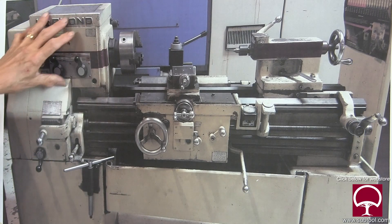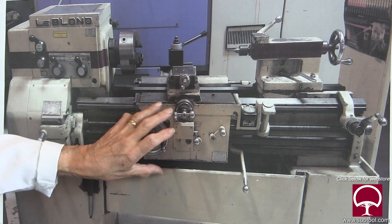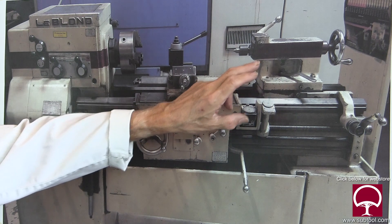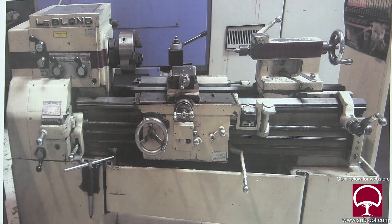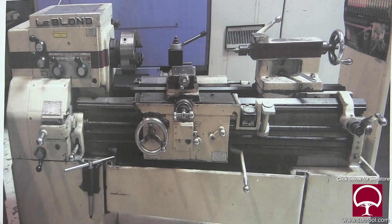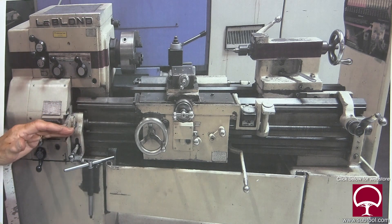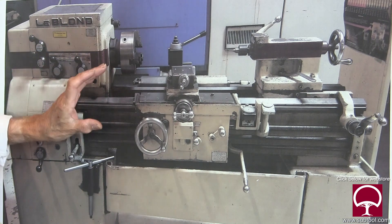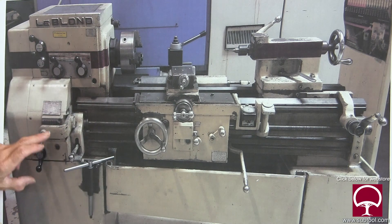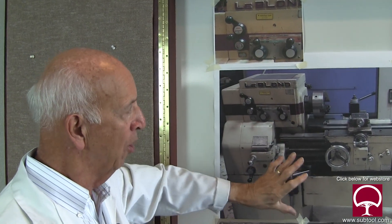This is, of course, the main gearbox. This is the chuck, which you clamp your part in. The carriage goes right and left, one goes in and out, and then there's a cross slide as well. Tail stock for supporting goes in and out, and we have the lever to turn on the spindle. We also have the ability to change speeds via these levers, which controls spindle speed, carriage speed going right to left or in and out, using this box and the levers up here.